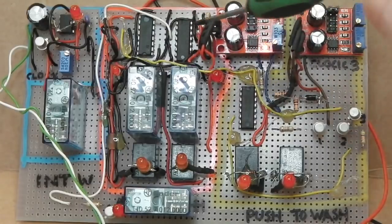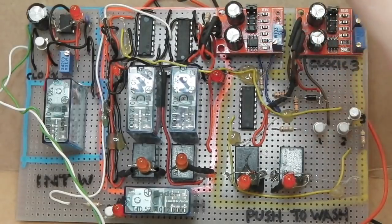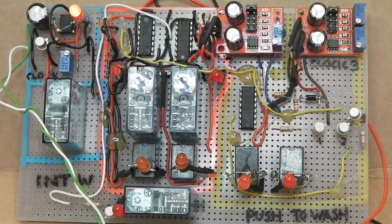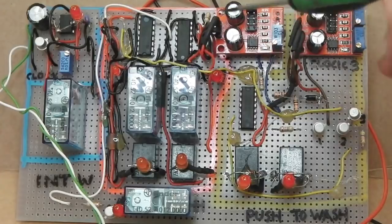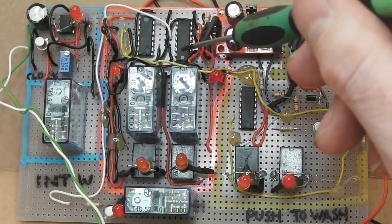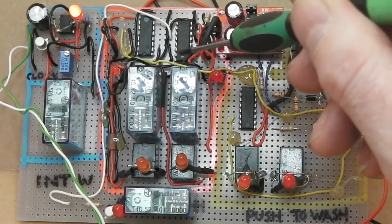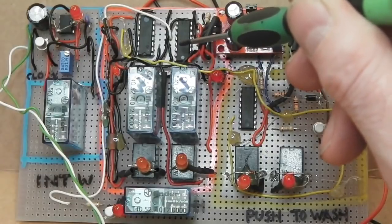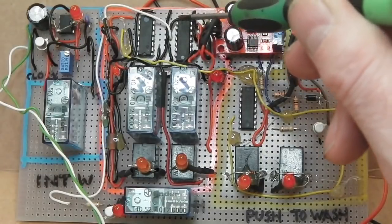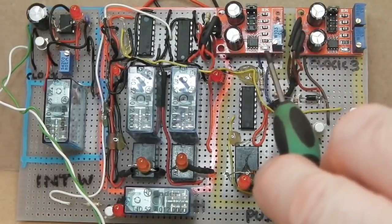Each time that's flashing, one of them pins goes 12 volt, then it goes off, then the one next to it goes 12. So by putting in little link wires, it almost creates different time circuits. Let's say this LED is flashing once a second, 1 hertz, then these pins are moving upward once every second. So the first pin's going to be off, this comes on, that goes 12, then it goes off, 1 second later the one next to it's gone on, then that goes off, and then the next one goes on, and 10 seconds would be the 10th pin. So you can actually use it to make time circuits depending on what you set your clock at.